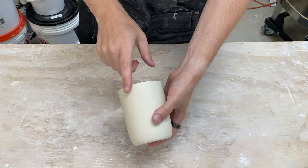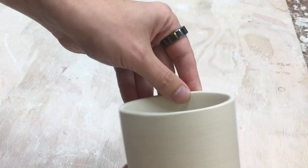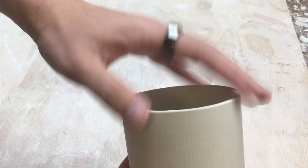The other thing I wanted to show off is the rim. With the integrated slip well, I was able to trim that off very cleanly — I just took a sponge and wiped it off a little bit. Overall, I think this is a win in the process as well; it's much easier to create this rim than in the previous versions. Overall, I'm going to call that a success. We were able to address some of the problems from our previous videos — we were able to scale the pot up to address for the shrinkage, and we integrated the slip well, and that let us get a nice rim. In the next video, I'm going to dive in a little bit more into how I created this 3D model and the associated 3D print. As I alluded to, I've been working on some software to try and make this more automated — I have an initial version working, and I'll talk about that in the next video. If you have any questions or comments, let me know. Thanks!